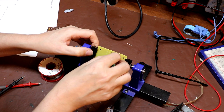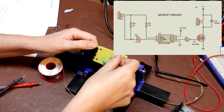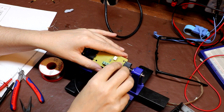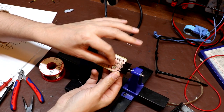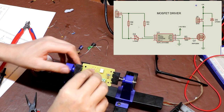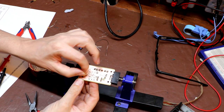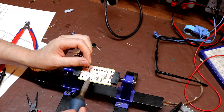Decided not to put the MOSFET driver IC in a socket because there's not much clearance — a fuse holder sits above it. Skipping the socket means it'll probably fail almost immediately. Next is R3, the current-limiting resistor for the opto-isolator LED, at 1.5k. Then R5, the 100-ohm gate drive resistor for the MOSFET. I'd quite like one of those component leg-bending jigs — might have to 3D print one since it would make installing resistors neater.